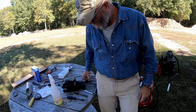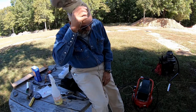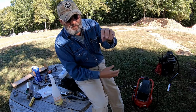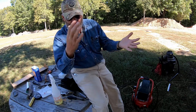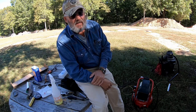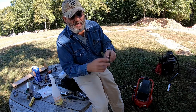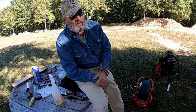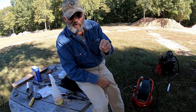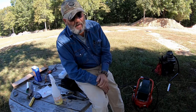It is, I suspect, not getting enough propane. And part of the reason I suspect that is that there is an indicator on top of the regulator assembly, red for it's out, green for it's good, and as soon as the furnace tries to light, it goes almost full red, indicating that it's out of propane. And it doesn't matter what propane appliance you turn on, it shows a little bit of red. So I'm thinking that it's not getting enough propane gas flow. I'm going to try that.